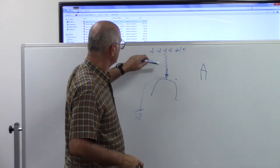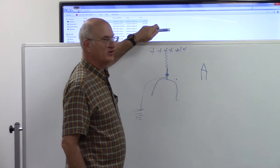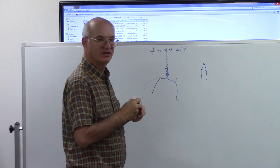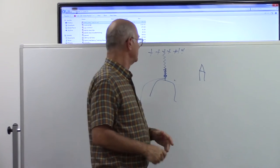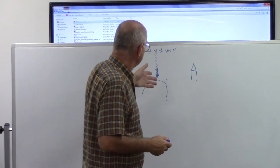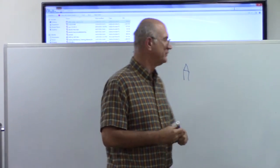The strike occurs when there's so much potential between two points that it violently jumps. And once the current starts to flow at that level, it basically melts everything until it's all gone. And that's what will happen in a major lightning strike. But enough of these in an area will keep that potential to the point where it'll choose to bleed slowly as opposed to one big jump.